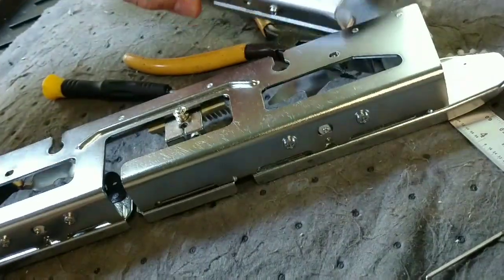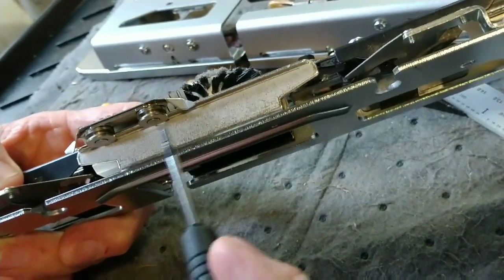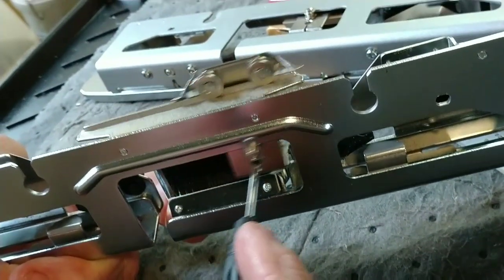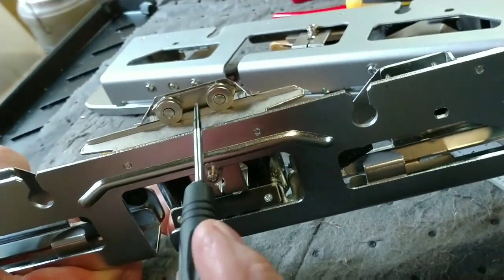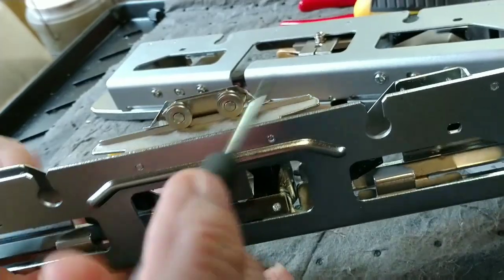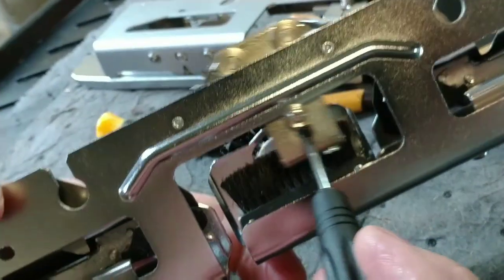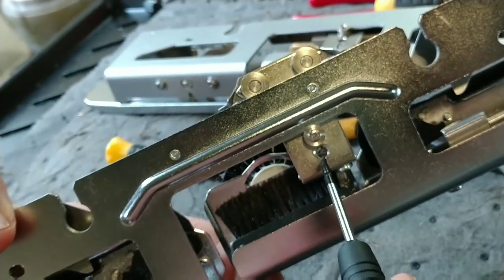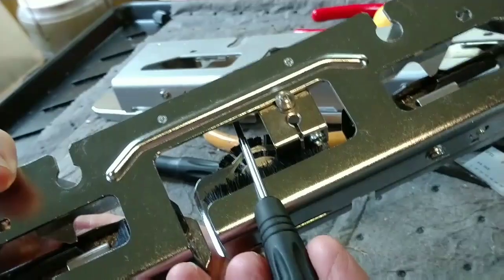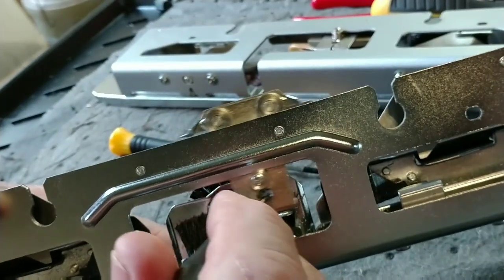A knitting friend said he's having a problem. I found several things instantly. One of them is this has a very unusual floating yarn guide that you don't see anywhere else. And this is what we call a trolley wheel setup — you can see it rides along that rail. But it's trapped because the lower trolley wheel is also riding a rail. This one came in out of adjustment, so this lower wheel wasn't here — it was under it, which is totally misaligned. It'll never work. And it wasn't — it was breaking needles.